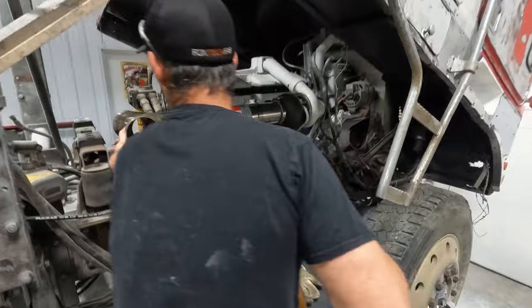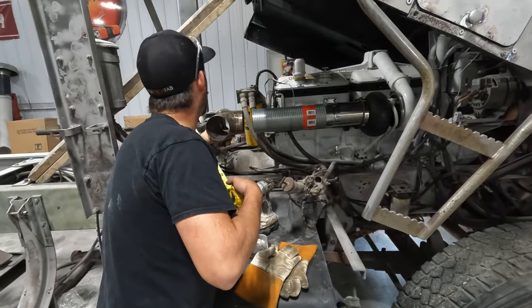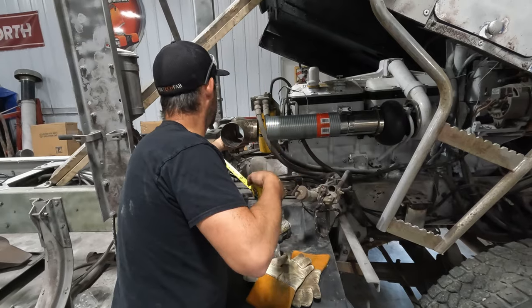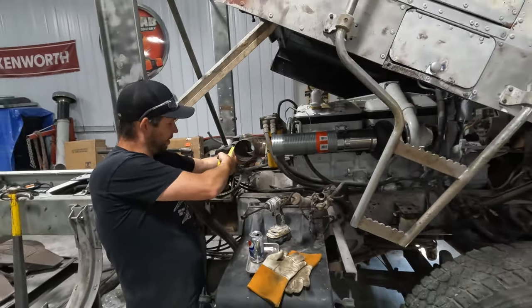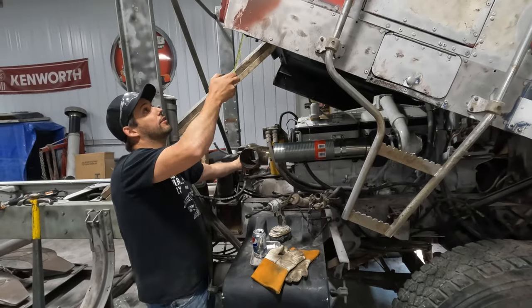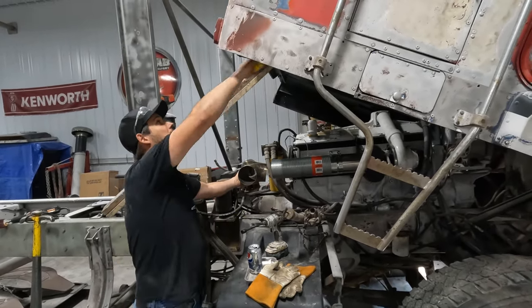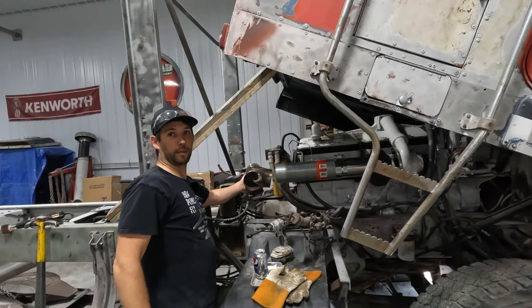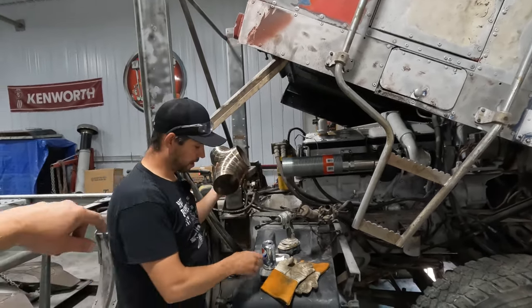And then the Y branch is out here. Which should clear everything. Yeah, and then we can lower the cab, make sure everything clears. And then I can actually take my center line measurement off of here, and then I can relate it into where it needs to be here so I know how much to offset down. So we're clearing everything on the bottom of the cab here. What holds it up though? I guess it's gonna be solid pipe around the band.